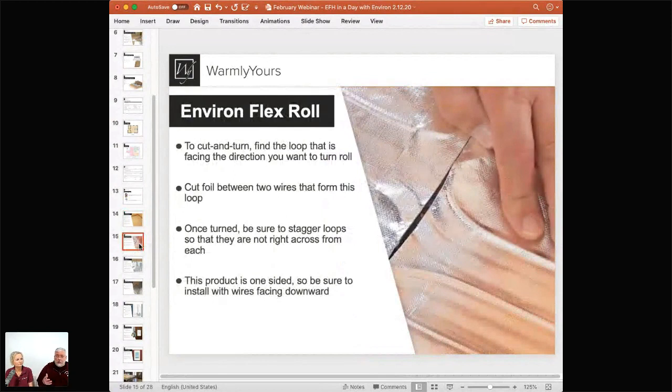To install the heating element per the plan, first do a pre-fit: take the Smart Plan and measure with tape and marker to confirm each run will fit in the room before cutting anything. If the room has shrunk between ordering and delivery — which happens — you'll find out before you've cut anything and can get the right product out. Never cut before you've confirmed it fits.